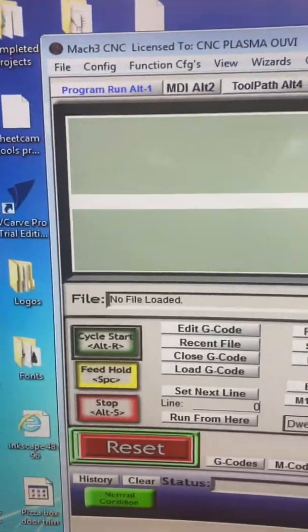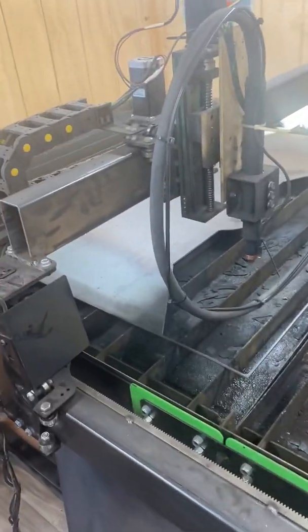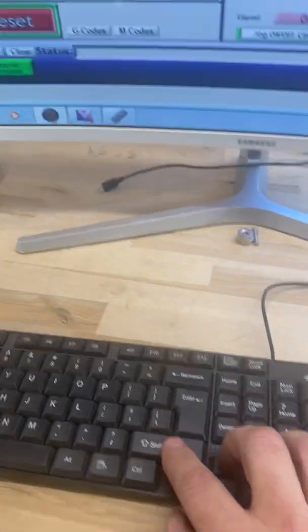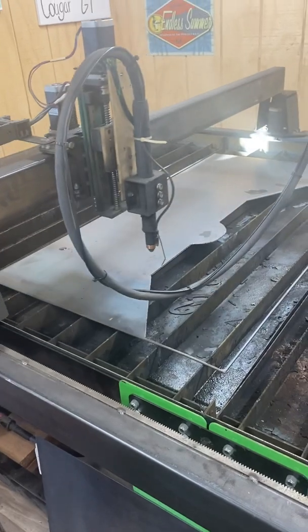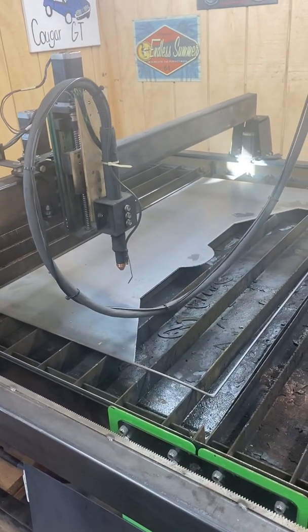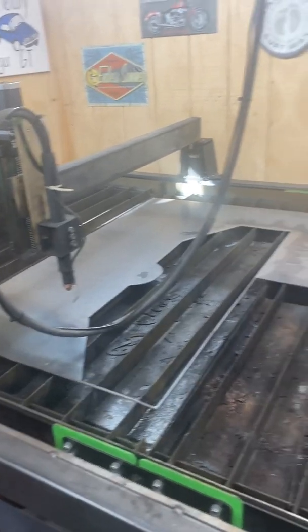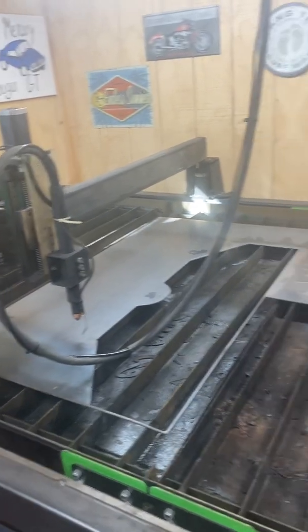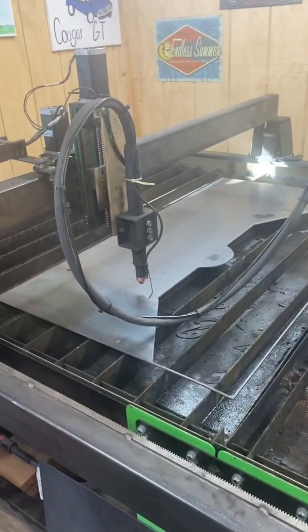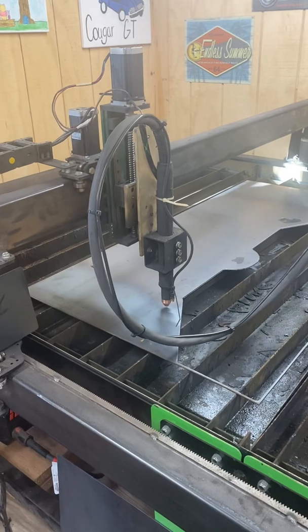I've got my table almost set up — I'm going to move it to zero, or where I think zero is on my table. Right now the torch is just kind of floating here. One shortcut: if you want to move fast, hold the Shift key and press the arrow — that moves fast. Without Shift is regular speed. If you hold the Control key and tap an arrow button it moves in very small increments. What I want to do is create a new zero spot, so I'm going to lower this and get it as close to where I think my zero-zero for the table should be.